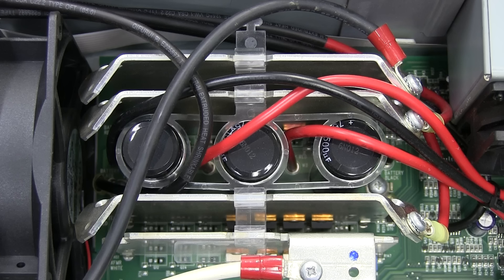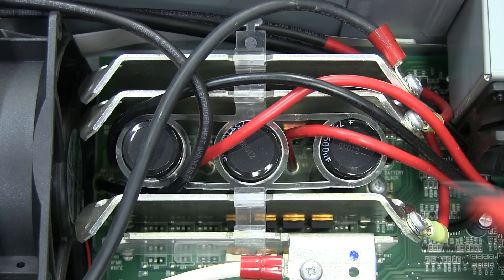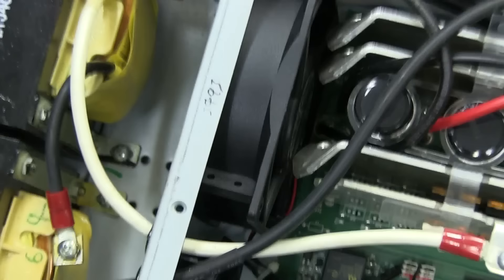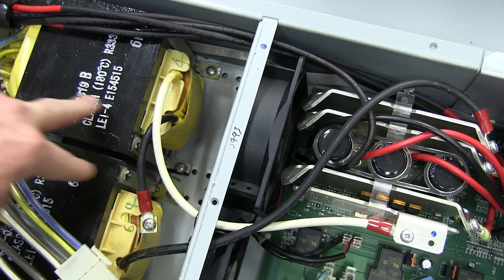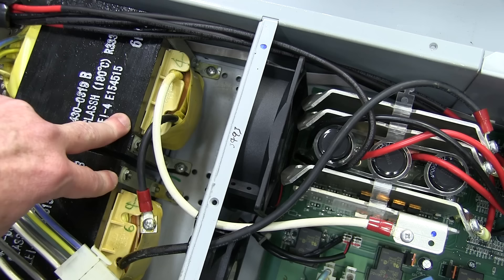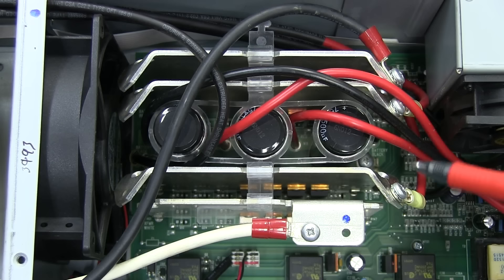Now I've had a little head scratch over this rectifier thing, and some people are probably screaming at me right now saying it's obvious — and it is obvious when you think about what they're actually doing here. This is rather clever. There's a huge amount of capacitance in parallel with the battery and no other charger or rectifier. So how are they doing it? They must be doing it by tapping off the output of the transformer. The transformer is not actually switched — they're always feeding power back through the transformer in the other direction, back into the H-bridge itself to actually charge the batteries.